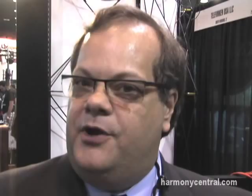We also have really great metering, so you get input and output levels set very easily. The other thing we're doing with this is we're custom voicing our transformers. We actually use three transformers per channel, not including the power transformer. We use a separate transformer for the mic input and then a dedicated transformer for the line input, as well as an output transformer.